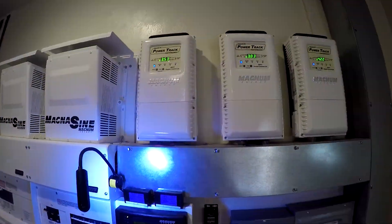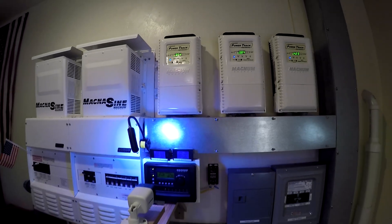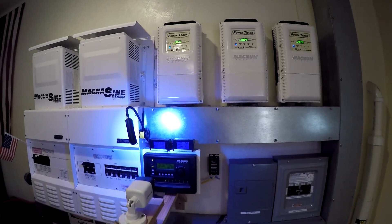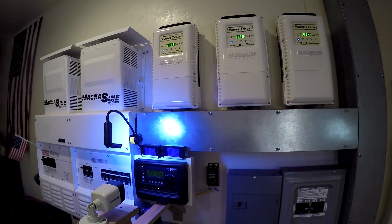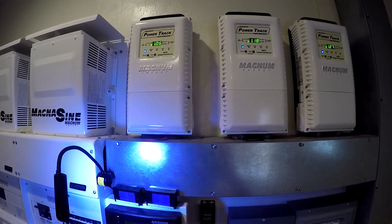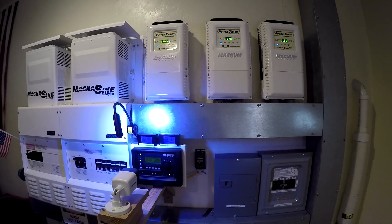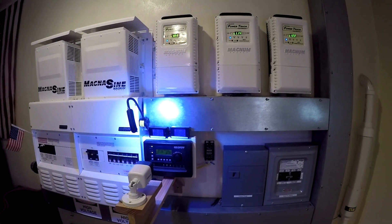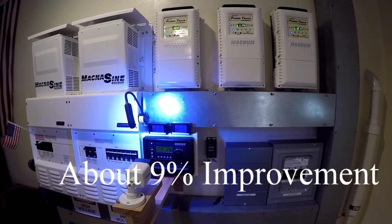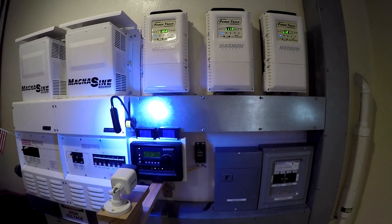We've got 352 to 384 — wow — that's 300 watts difference, and I've only done half, so we're going to pick up 600 watts. That's significant. We went behind a cloud and now we're 105 to 118, so that's only about 130 watts difference at the lower end. So we're going to pick up like 250 to 600 watts probably, in that range depending on how much sun is hitting the panels. Definitely worth cleaning.